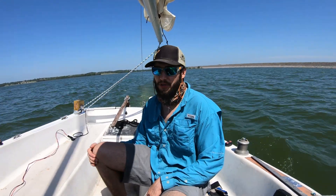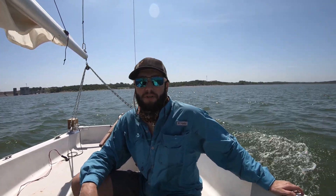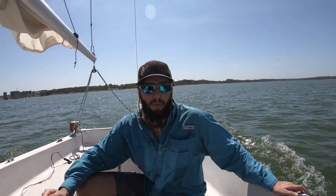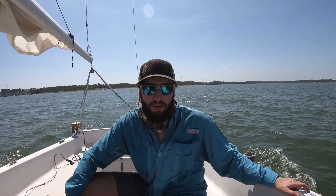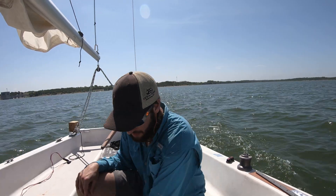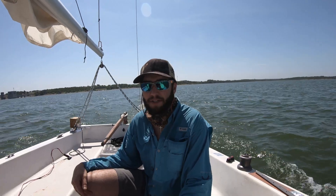This is doing significantly better. What I'll probably do here is drop the keel and hoist the main, and see how the autopilot does with that. With the keel down it's going to help the stability of the boat quite a bit — it won't go back and forth as much. But it won't help dampen the anemometer input, so I may need to do some sort of averaging. The beauty of this now is I can motor, tell it to point straight into the wind, hold that with autopilot, and then hoist the sail without having to manage all the lines.